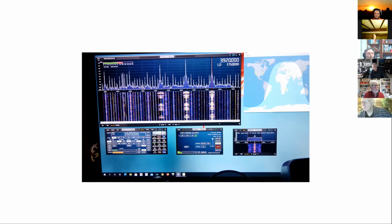Yeah. So now you have a nice picture using an SDR. Do you also see the same problem in any of your other receivers? Good question. Yes, I do. My ICOM 706 is also seeing the same, or I hear the same stuff out of that. So it's not purely a digital problem. It's definitely something real that's not an internal digital glitch of any kind. Yeah, and that also reduces the likelihood that it's an overload issue with the SDR. Okay. Right.